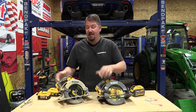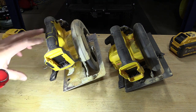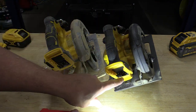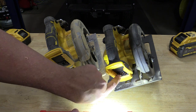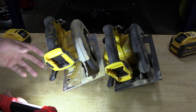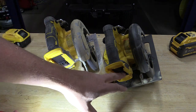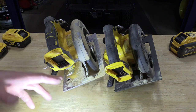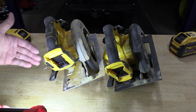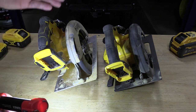Let's quickly look at the connections in the back, because that's something important. On the 20 volt Flexvolt Advantage, you have four connections. On the actual Flexvolt, you have six connections. So the question of whether the Flexvolt Advantage is just using the same motor and boosting the voltage is definitely ruled out — it's not the same motor, not the same internals, because of how the connections work. We're still running at 20 volts. No matter what we think could be happening inside the saw, it's definitely not boosting itself up to 60 volts just to make the cut, and we proved that in performance.